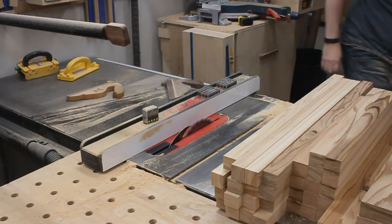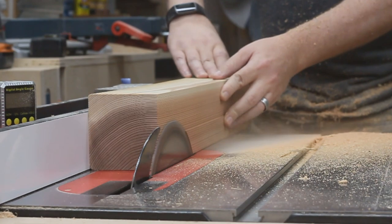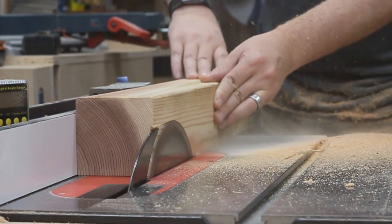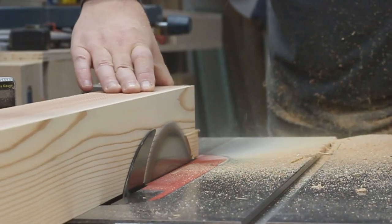Next up was dealing with the 4x4s. To remove the rounded edges, I had to perform each cut in 2 steps. After the first, I'd just flip the piece end for end and then I'd trim off what I couldn't reach on the first cut. Plus, this gave me a chance to completely cover myself in cedar sawdust,